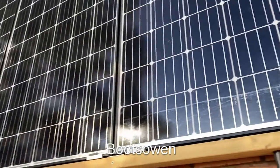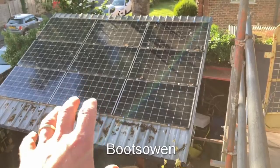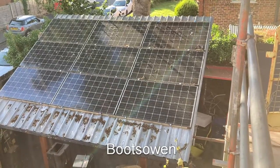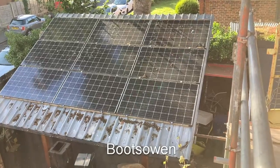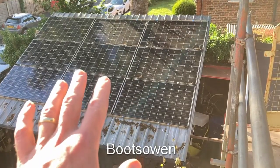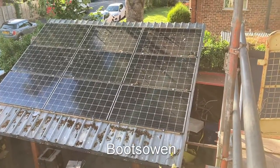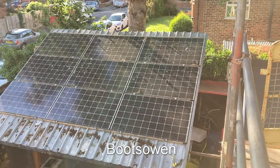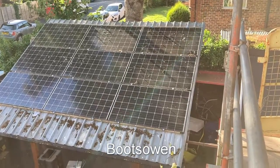I've mounted them on a wall this time. This solar carport I installed about six to eight months ago, and they've done over winter. Originally the plan was that they would be roofing themselves, but in the end I had to take them off and put tin down because they leaked everywhere. That's the nature of solar panels — they're not watertight, bizarrely, even though they're glass. They're not sealed into their own frames, even though they appear to be.